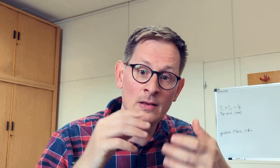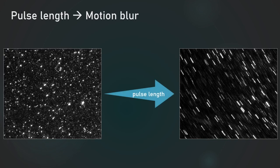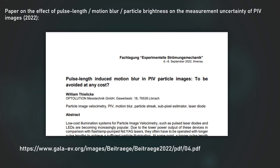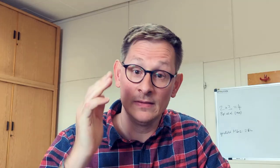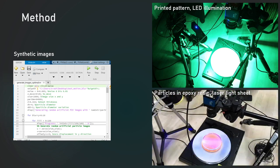Laser diodes, on the other hand, are toggled on and off by driver electronics. A single pulse doesn't have a higher peak power than when the laser is turned on continuously, so if you need a lot of light, your pulses need to be longer — and that obviously leads to motion blur. Motion blur has been analyzed in a few studies already, and I also analyzed the effect directly in PIVLAB with our laser diodes with a little setup. The results were presented at a German conference. The paper is available as open access, and if this is interesting for you, please check it out — I will try to put the link in the description.